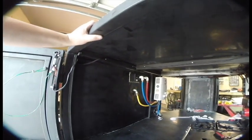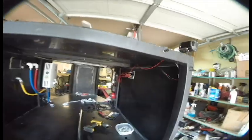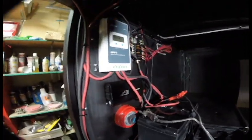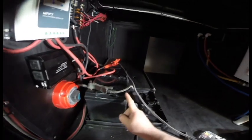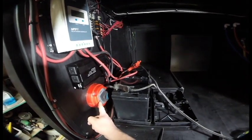I think that means this thing is ready to roll out of the garage. There are still a few more battery cables to make when the battery arrives, and some cleaning to do in here. But to give you the layout: the solar controller has input from the solar panel and output to the battery. The battery is right here, and then we have the ground of the load connecting to the fuse block, with the positive of the load going to input number two on our switch.